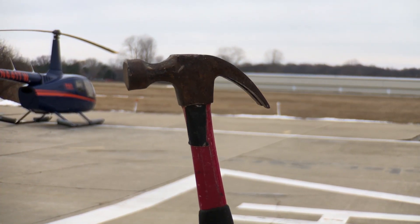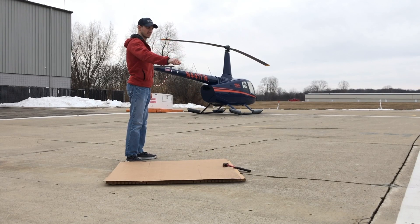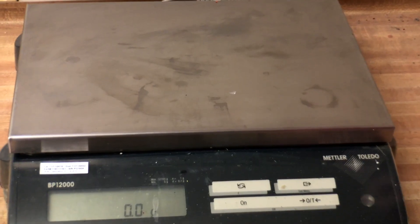The blades must also be balanced very, very accurately. This is made more complicated by a concept known as moment of inertia, which is the physical distribution of the mass of an object. A perfect example is a hammer: a hammer is one foot long, but all of the mass is distributed in the head. When you drop a hammer and a similarly-weighted straight object, one has a tendency to spin and the other doesn't — because although they are roughly the same weight, the distribution of the mass is different. This means that even if the rotor blades are the same weight, they may be out of balance when they spin together, requiring mechanics to adjust tiny weights in the ends of the rotor blades until they fly together perfectly. The balance is so sensitive that even tiny paint flakes can cause a noticeable difference in ride quality — if the paint chips off over time, the rotors have to be rebalanced.